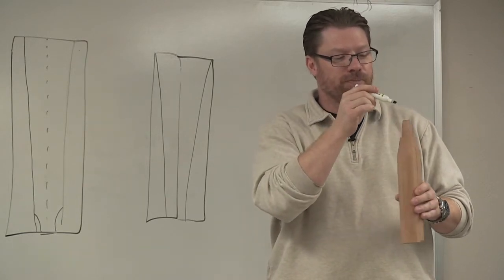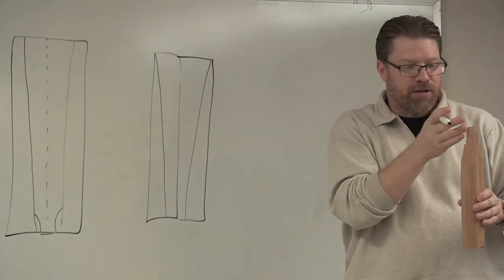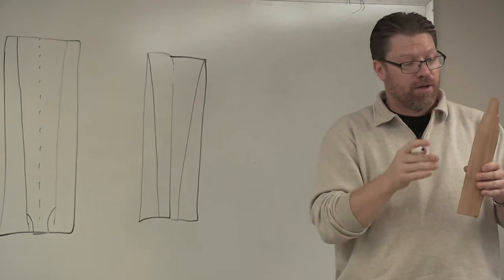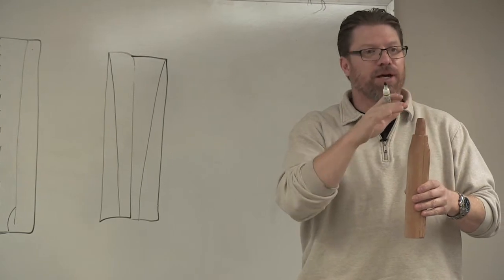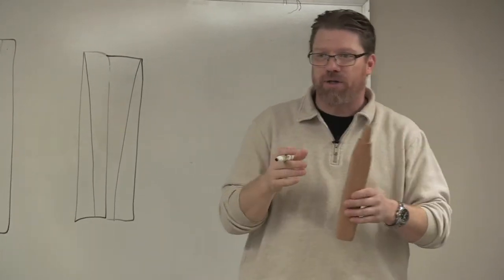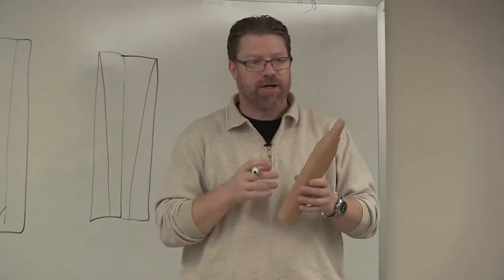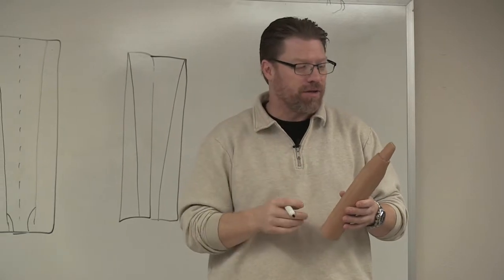because the process of starting the split involves carving in a little bit, and it damages the top a little bit. When you put it back together, that part won't go back together like the rest of it will. So when you split the wood, leave some extra length so you can cut it off. The whole point behind splitting the wood is that it goes back together so perfectly. Once you clamp it and wrap it, you really almost can't even tell there was anything there.